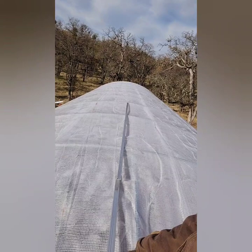We're about halfway done with running channel, have the other half to go — hot wheeling them together, like I said, and tech screws going into every hoop. Once we get this done, we will throw ropes, pull the blackout plastic over, get it where we like it. I'll show you how to tack it, and then we will get on top and wiggle wire the whole thing and do the roll-ups.